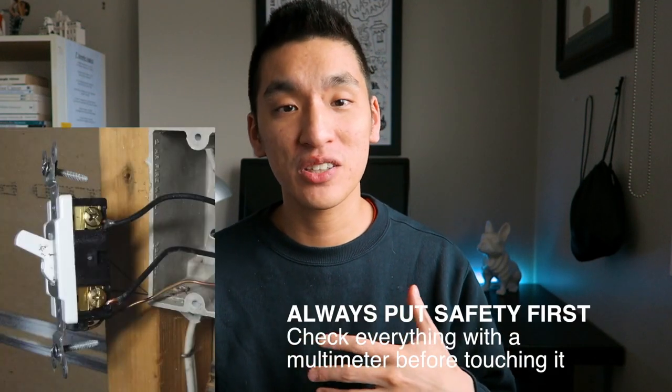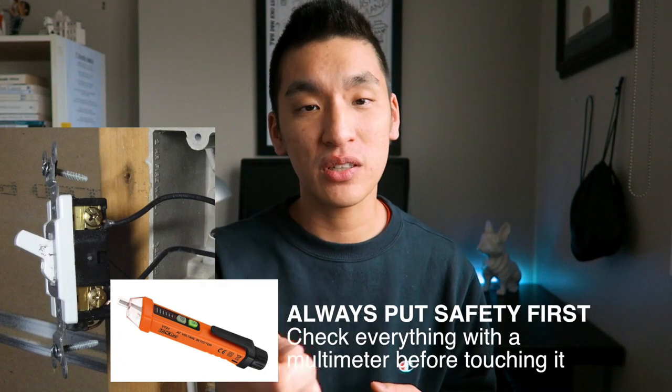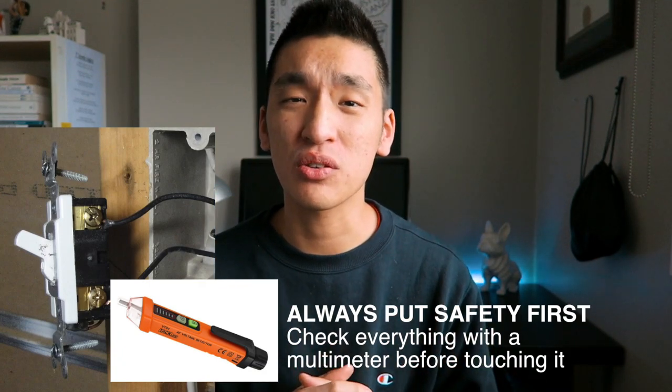Mine's just held up with two flathead screws. And it's safe to take the actual switch out of the wall, which is also held up with another two screws. And like I said, I really need to triple check things because I'm just really cautious when I'm doing these things, and use that voltmeter to make sure there's really no power running through those wires.